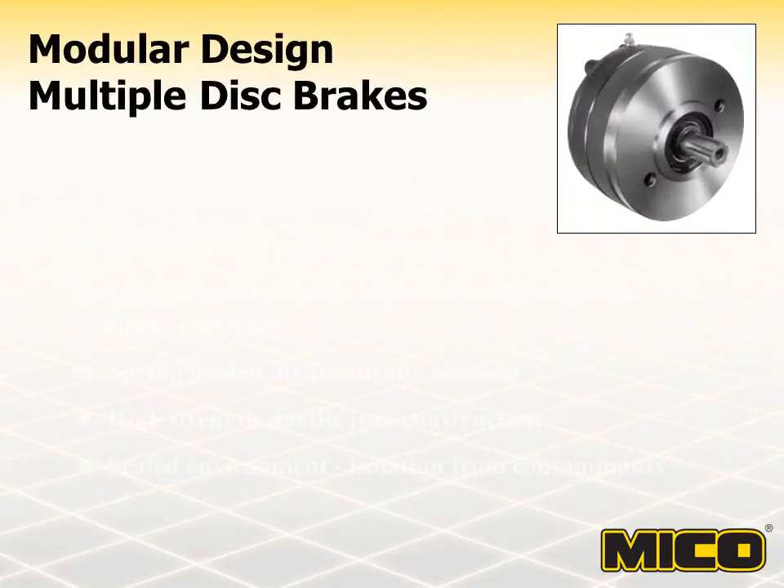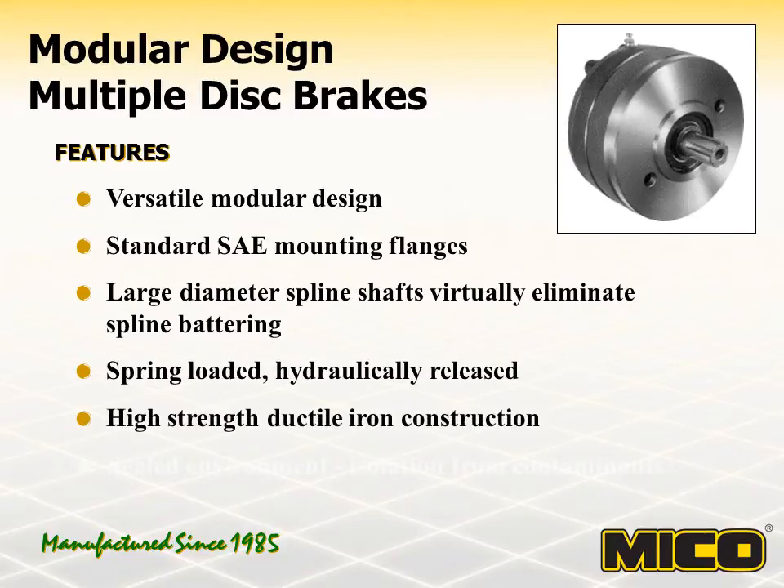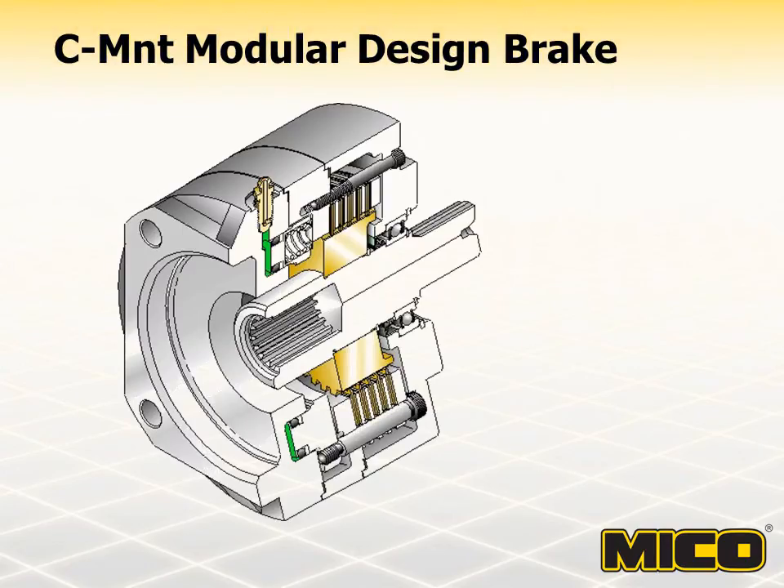Myco modular design brakes are available with the same variables as the dry design brakes. They also have oil-cooled, speed sensor, and double bearing options available to them. The oil-cooled option allows for flow-through or sump oil cooling inside the lining portion of the brake. In static braking applications, this fluid is primarily used as a deterrent to corrosion of internal parts when the brake is used in adverse environments.